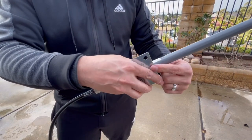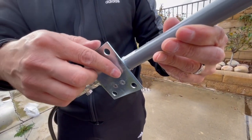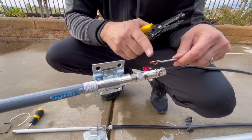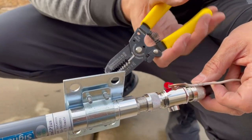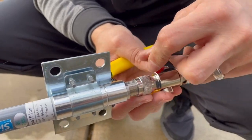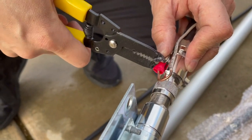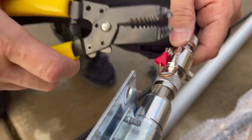What you want to do is have the flagpole a little bit below here — you want clearance on here so it's not blocking at all. If you guys saw when I pulled the other one off, it had a little bit of blockage at the bottom because the pole was covering it. So I want 360 degrees. I'm working with the 12-gauge for the grounding wire. We're supposed to put it all the way in there, and then I'm going to clamp this little red plastic part. I'm also going to be using zip ties to secure this, and then I'm going to put some sealant tape over it.